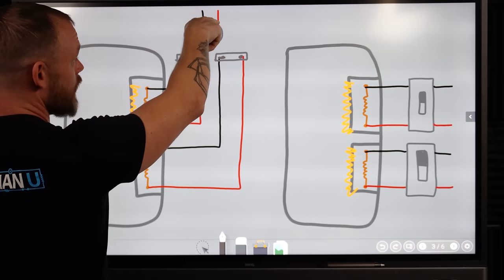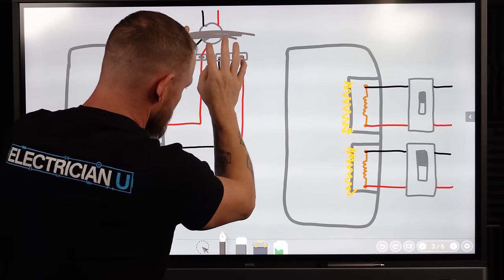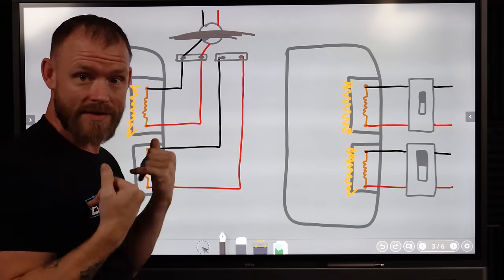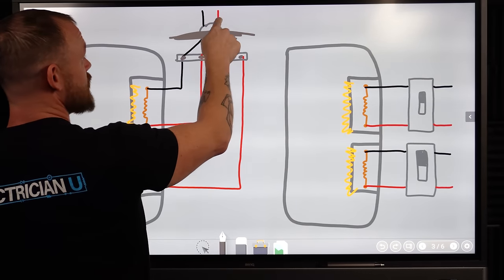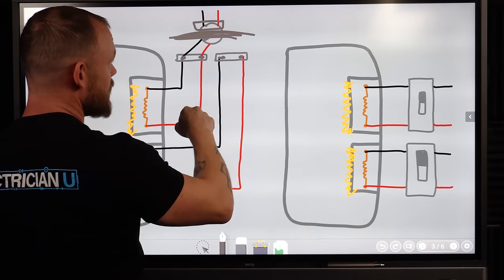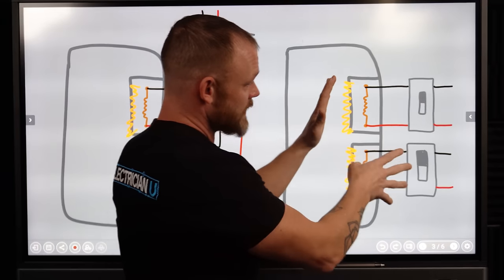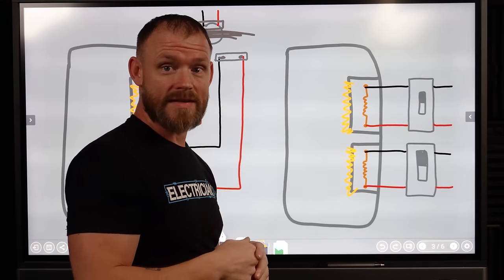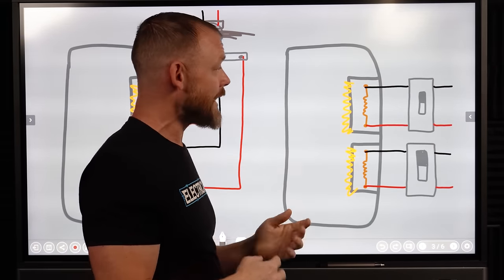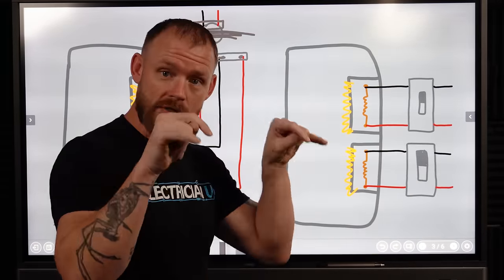So when you've got your incoming power, it's completely isolated from any of this stuff. We land our wires up here. The AC guys, if it's a furnace or whatever, they're going to run all the low voltage stuff. That has nothing to do with us. So in that situation, you'll probably have a terminal block here where you land your wires, or you might have pigtailed wires out that you have to wire nut onto. Everything else is controlled by whoever's installing the thing, and it's usually not us. With something that's more like what this person had sent in, they're running wires directly to the elements. That's a different thing. So if you're having to run wires to two different sets of elements, you're going to see two elements in there, and they're running straight off a breaker. So you're going to run your wires in and land them on two sets of elements.